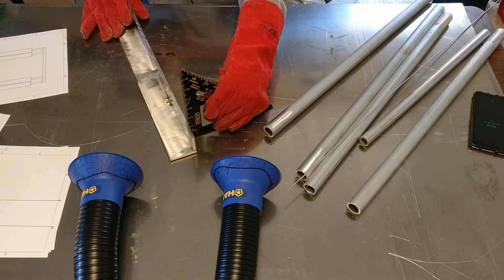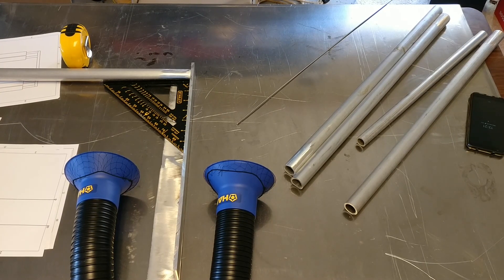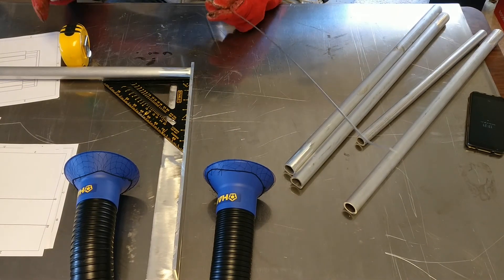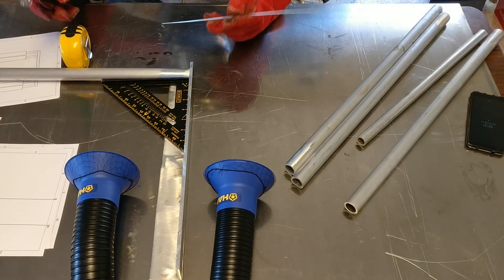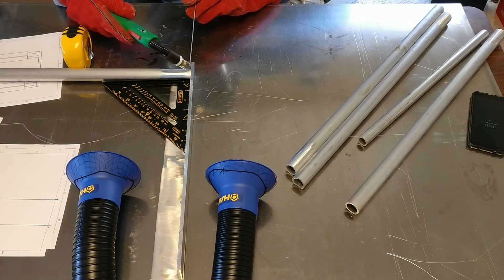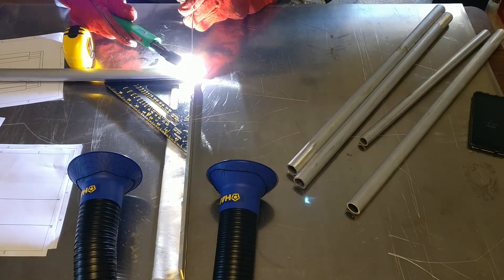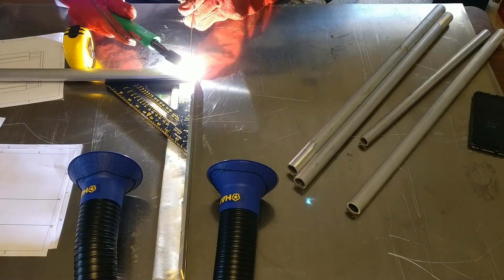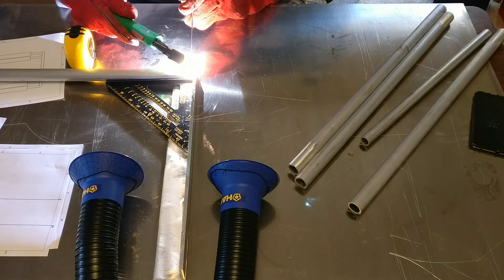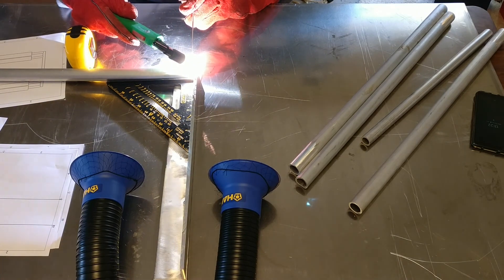Next I put the pipes. I started welding the pipes and it's critical that everything is squared. If not, everything will be crooked and you definitely don't want that — it'll look bad and be poor work, and will probably make your skis sit sideways. I started working on the outer pipe, giving it a little tack weld. I did cut short some of the welding in this video because aluminum takes a while to weld — you need to build up the heat — so I skipped it.